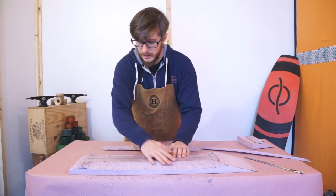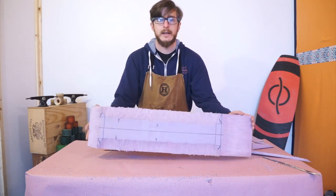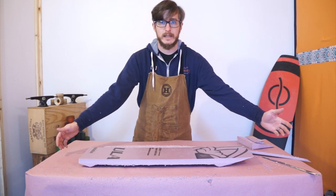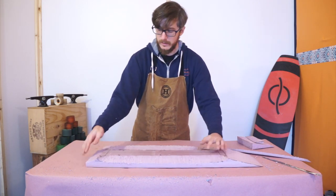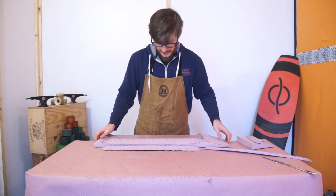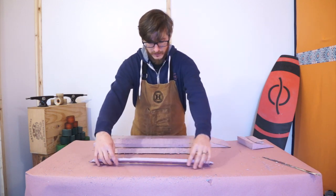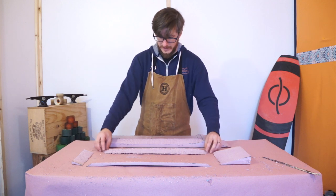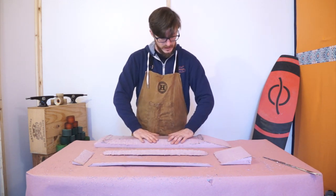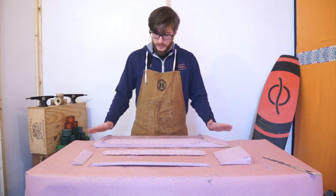So what's left are five pieces of foam. This block is going to be the male side of our mold — you can see the skateboard would be oriented that way. We've got a kicktail, we've got a little hook for the nose, and we've got our concave. The female side is just going to be the parts that we cut off opposite of that. We're going to glue those in place, and when you put material between the two and clamp them together, it'll press all of the plywood into the shape of the board we're looking to have.